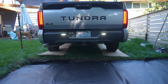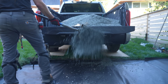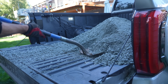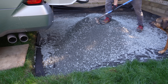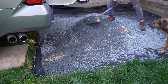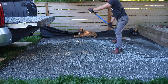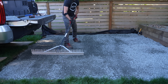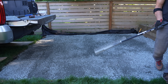For this type of project, you want approximately 2-3 inches of crushed rock over the entire area to ensure proper compaction before we get to our deck. This material is called 5/8 crushed minus rock, which means there are small rock particulates in the mix so you can easily compact it after it's spread out evenly. Once dispersed with a shovel, I grab a lawn rake and try to rake it out as smooth as possible.